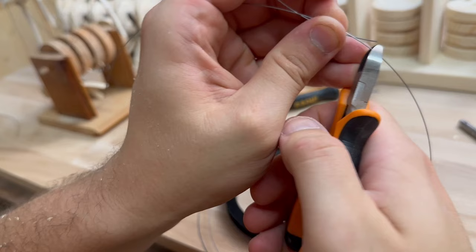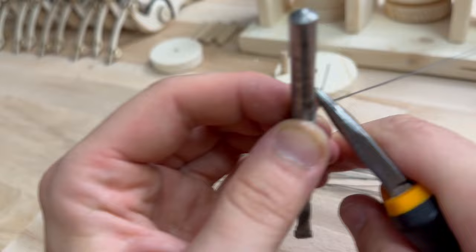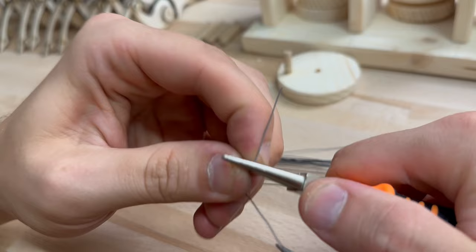The connection system of the mechanism to the horse is made of harmonic steel. It is rather hard to bend, but its hardness and elasticity is perfect for this purpose. If I had made it in iron wire, it would have bent during the movement, blocking all the mechanism. This was another very long part that took me several hours of work.